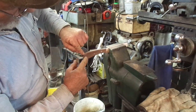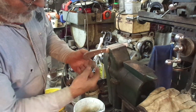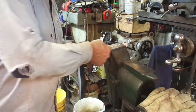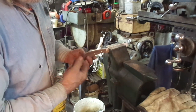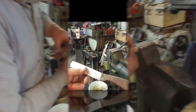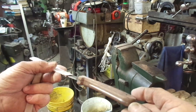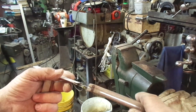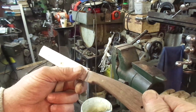I'm missing one rivet here - I've got to get a little more epoxy and put a dribble down in that hole and reinstall that rivet. I used lineup punches to align these - three pin punches. What happened is I pulled the pin punches out before the epoxy totally settled, put in a rivet, pulled the next pin punch, put in a rivet, but by the time I got the third pin punch pulled out the epoxy was already too far gone and it didn't hold that third pin secure enough. It's only a mistake if it can't be fixed. This is a little scrap of walnut off a project I haven't put the videos up for yet. I still have a little finish sanding to do and then the final finish sanding with 420 or 500 grit.